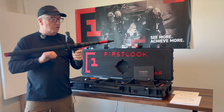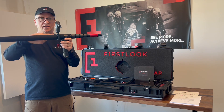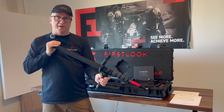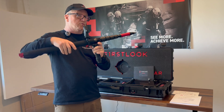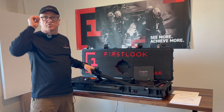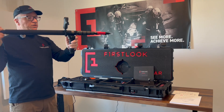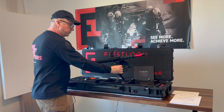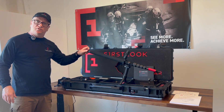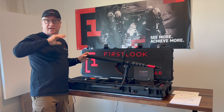The pole telescopes out to 10 feet. Ten feet is the maximum depth for underwater use. You run the cord down through the pole, attach it to the camera, put the environmental lid on, and you can go 10 feet into the water. It also fits nicely in this case so it can fit onto a pallet — logistics teams were always coming at us when bigger cases wouldn't fit. We include a bipod so you don't accidentally put the camera into the dirt, and it acts as a leverage point when the pole is fully extended, although this camera is fractionally lighter than any competitor in the marketplace.